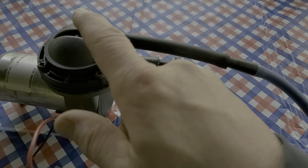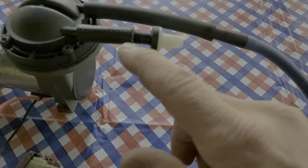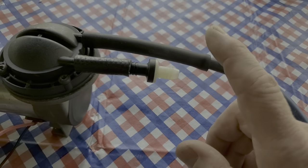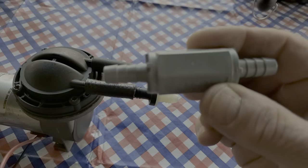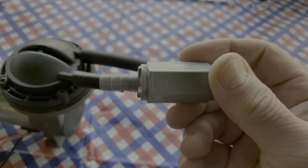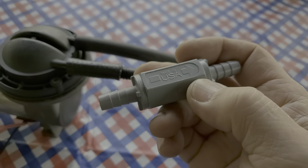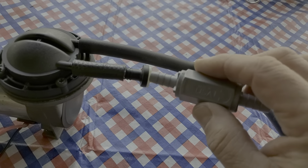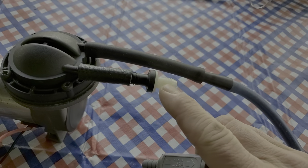There are two little check valves inside here that blew up. Well, you can buy this for either $5 or $6. And if this side goes, you would put this one in — this is a little bit more expensive one. Notice the arrow goes that way, so that would be out. I use a vacuum check valve on this side, hence the black and the white — you can use a vacuum one from the auto industry.